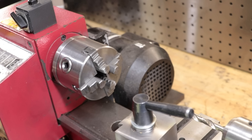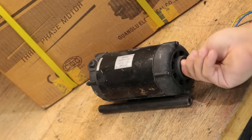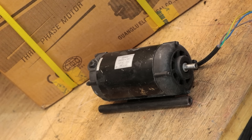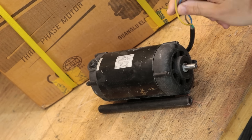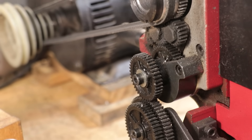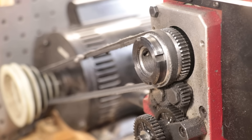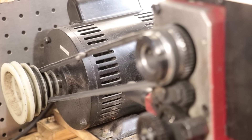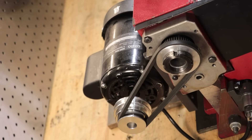For context, three horsepower is six times the power that the lathe came with. The topic of how I power this lathe has come up a lot — from the factory it comes with a 350 watt DC motor connected through a gearbox to the spindle. The only reason I replaced that motor was because the DC motor board blew, and replacing those boards was almost $300 — nearly half the cost of a brand new mini lathe. So instead I pulled apart my drill press and connected the AC motor direct drive to the spindle using a pulley.